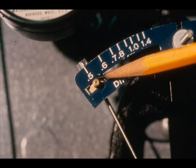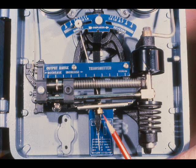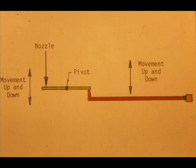For a given amount of torque tube rod rotation, the control link would move more if it was set at 0.5 specific gravity than it would set at 1.4 specific gravity. The other end of the control link is connected to the control arm at a floating pivot. One end of the flapper rests on the end of the control arm, held against it by a spring whose tension can be adjusted by loosening the screw and turning the disc. As the control arm moves up and down, it causes the flapper to uncover and cover the nozzle.